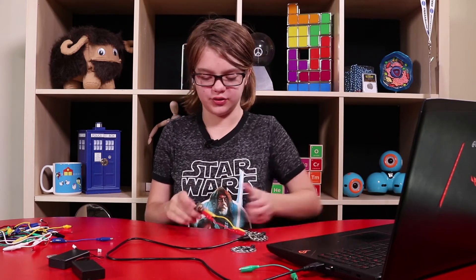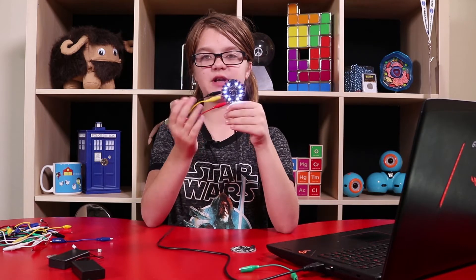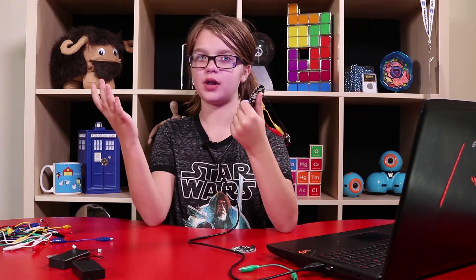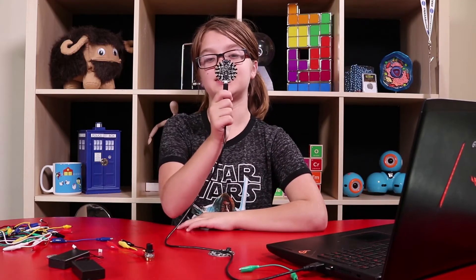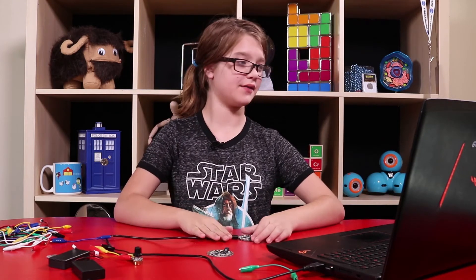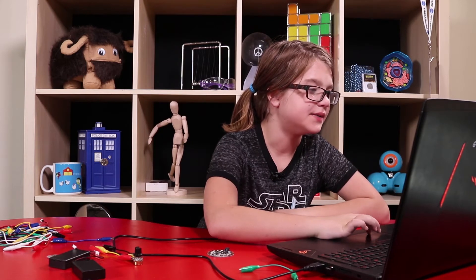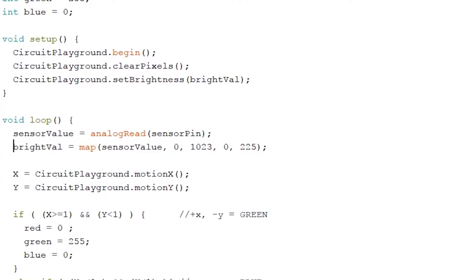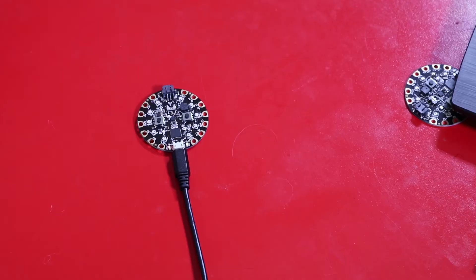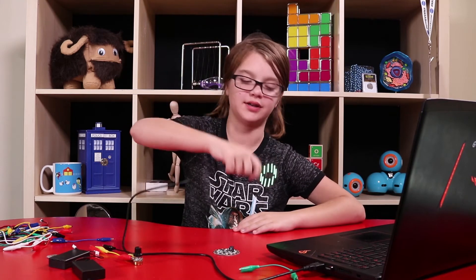Now I'm going to do something kind of selfish, but it's fine — and that is to take the potentiometer off completely, because it has a bunch of cables holding it on and it gets in the way. Also, since we haven't soldered them, it falls off a lot. So we're just going to take it right off. Now that I've taken it off, it's completely dark and not working at all. So I have to go into the code and comment out the potentiometer section so I can add it back easier. And yeah, I commented out the right thing — it's back on, tilting and working completely fine, but much more lightweight.